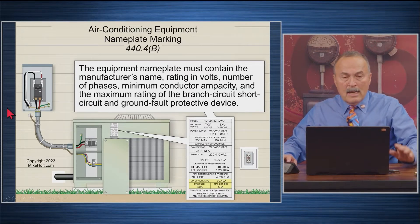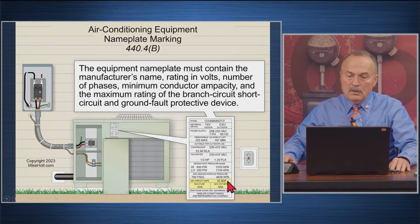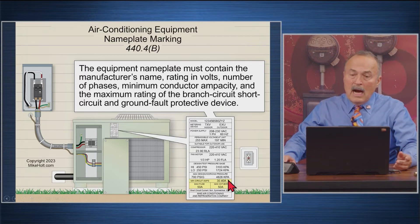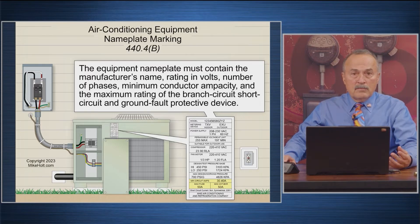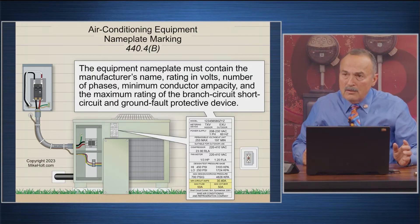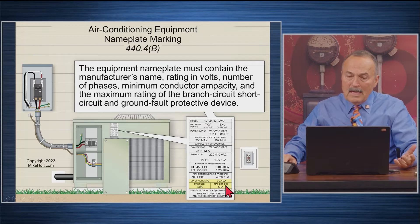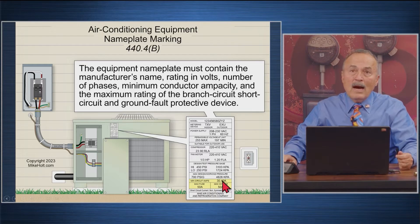This example shows: I don't care about everything else — I look over here. It says minimum circuit ampacity: 30.4 amps. So we go to Table 310.16, the 75°C column, and it's going to be 10 AWG wire rated 35 amps at 75°C. I ignore the asterisk at the top of the table — it might give the impression that I cannot exceed 30 amp protection on that 10 AWG wire. Then it says maximum fuse or circuit breaker — we go to 240.6(A), the table — and it'd be a 50 amp breaker with 10 AWG wire.